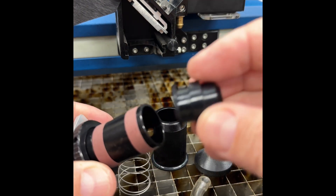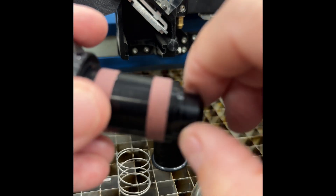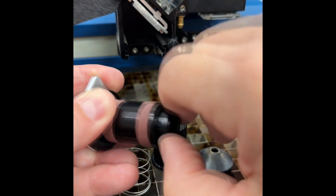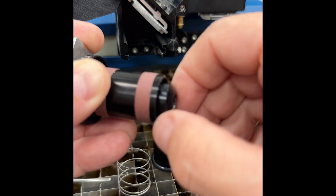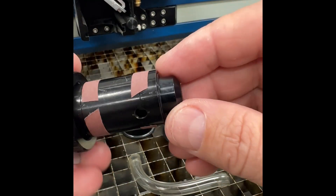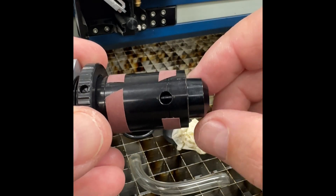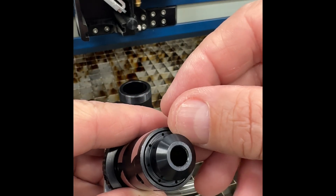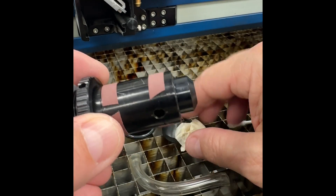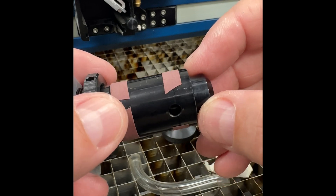Getting back to reassembly, take the insert and push that back in, then tighten it back up. After further evaluation, be aware that you can go too far if you thread the insert too far into the barrel. Be sure you're only threading it to where these two rims meet and are smooth all the way around — that's as far as you want to go. If you go too far, you can use some tape to grip it, twist and turn it out.